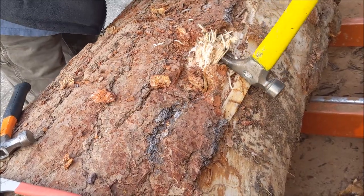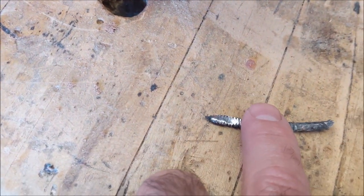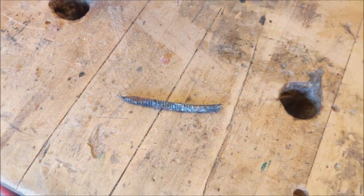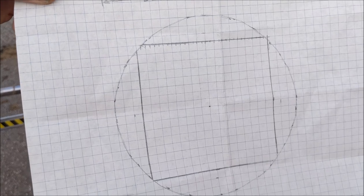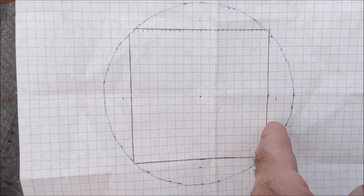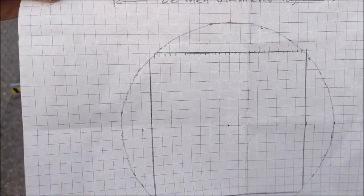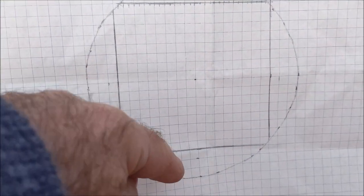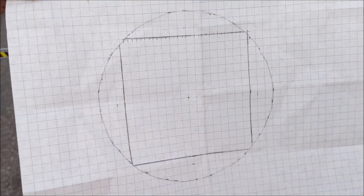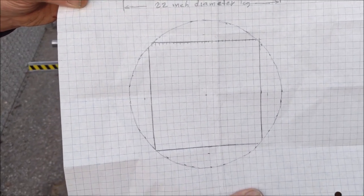There it is — pretty big screw. We ended up hitting it with the chainsaw and inevitably had to dig it out. So here's our log: 22-inch diameter. The rule we usually go with is 70% — that'll give us our cant. 70% of 22 is about 16, so if we take four off the top and four off the bottom that gives us 16. We want eight-inch boards plus or minus, so that'll work pretty well. We're going to mill it to that square block cant: 16 by 16.